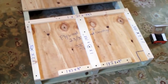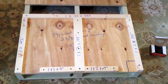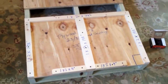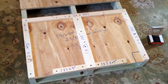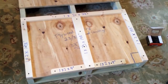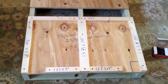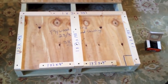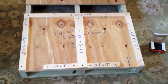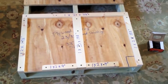On top of the decking, we've added some lumber — mostly 1x2s with a 1x3 down the middle — to act as furring or risers for the hive bodies to sit upon. This deck will also act as a bottom board, so we will just be placing the boxes on top of this framing, and that will provide the appropriate amount of space for the bees to come in and out. We're using 1x2s and 1x3s that we bought at the lumber yard. If you had a table saw, you could easily use the scraps from the plywood to make your own risers, which would be a lot cheaper. But we don't have a table saw, and this was the easier way to do it.